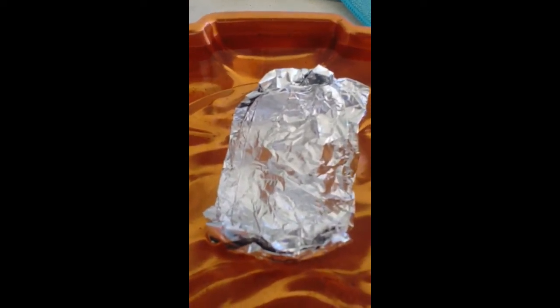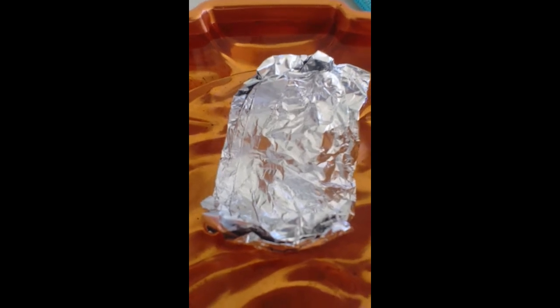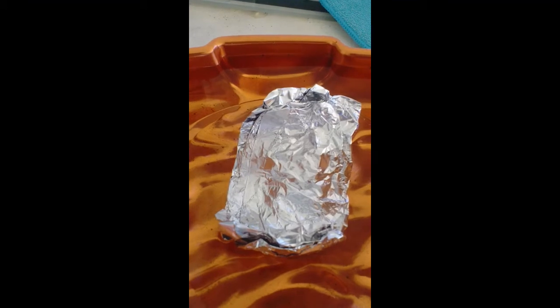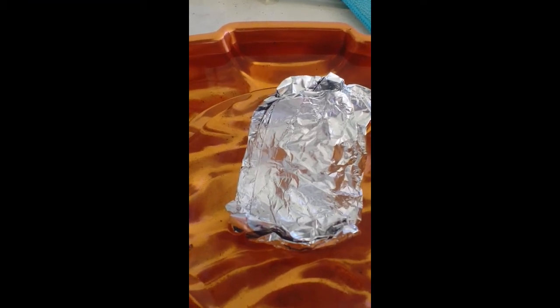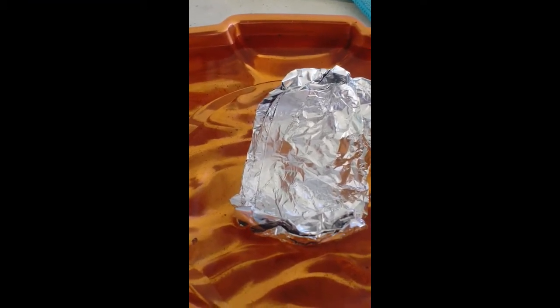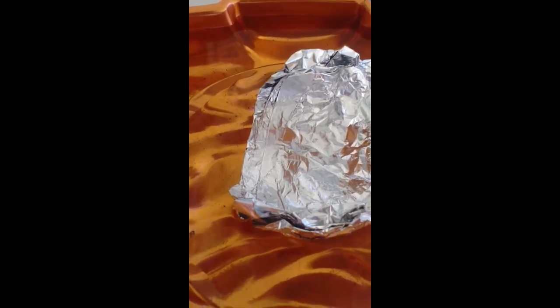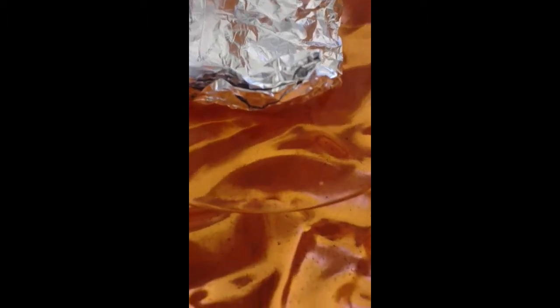This is a solar cell designed with specially treated copper and graphene nanoflakes. The copper has been heated up and then chemically treated in order to turn it into cuprous oxide, a semiconductor that's photovoltaic — it takes energy from the sunlight. To increase the energy available to this cuprous oxide, graphene nanoflakes have been added to the water that sits in the cuprous oxide.